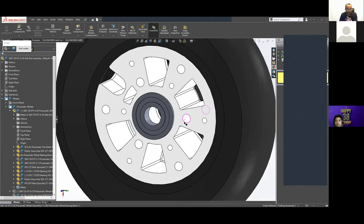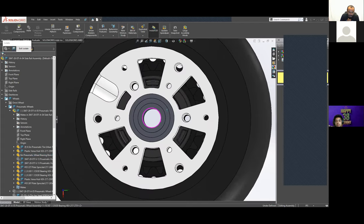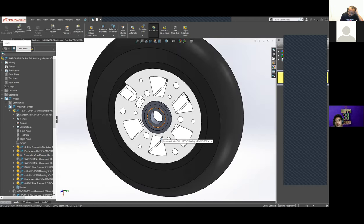And then for mounting all the hubs and everything, there are heat set inserts in the 3D printed part for bolts for both the sprocket assembly and the outer plates. Half of the holes are meant for tapping and half of them are heat set inserts, so we're not actually relying on either method fully, ever. It just would have taken a lot longer to heat set everything, so we can tap a little bit faster. The heat set inserts probably have stronger torque-out strength, which is nice, but it would have taken a lot of heat set inserts if we did every hole on every wheel.